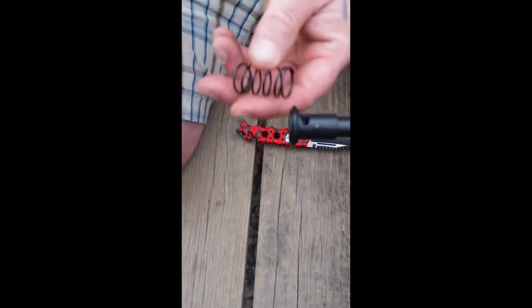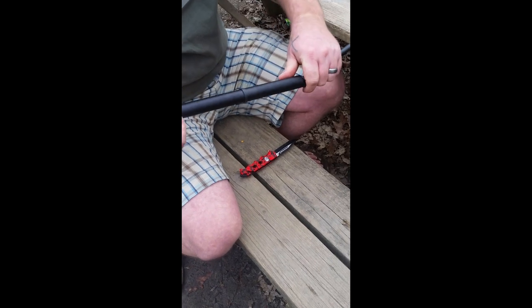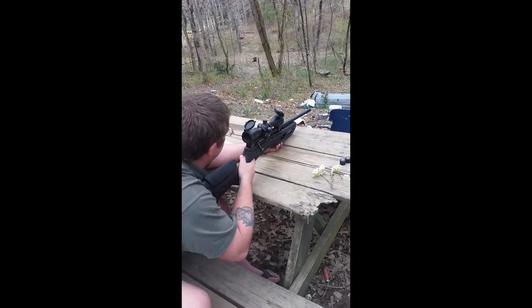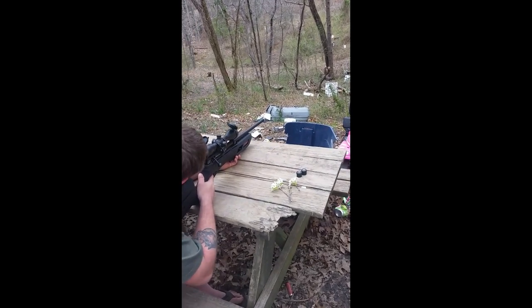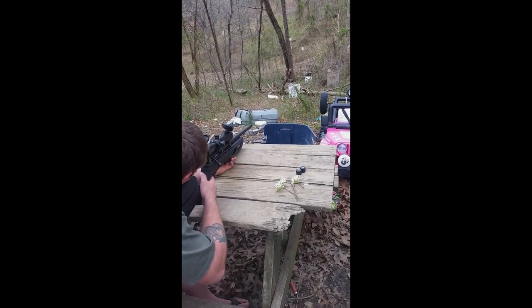But what Josh has done here is put another gasket on. I got a thicker one, and it's a little tight on the diameter with the shroud tube itself, but it'll keep that barrel from moving around. Actually, the O-ring we tried on it was too big, so we took a thinner one and doubled it, and it's keeping the barrel from moving, so we're going to find out. What was happening was it was off-centered and pellets weren't coming out of the barrel, they were getting jammed. It fired good. Now, after getting these first shots, one magazine ran through. What do we have? Boom.